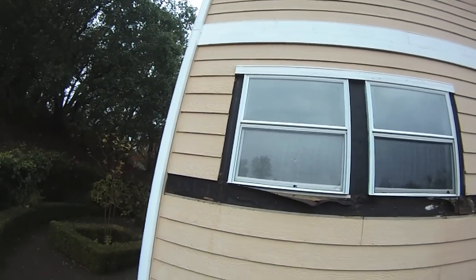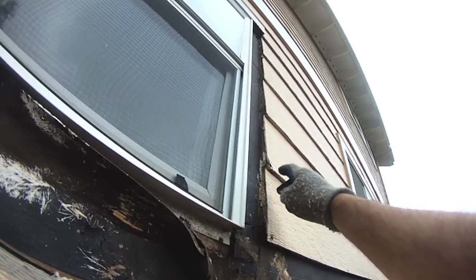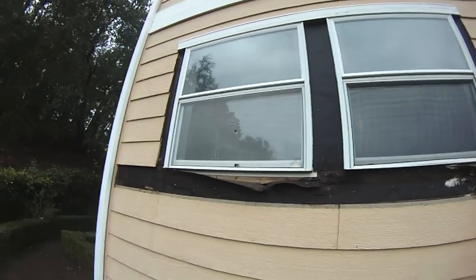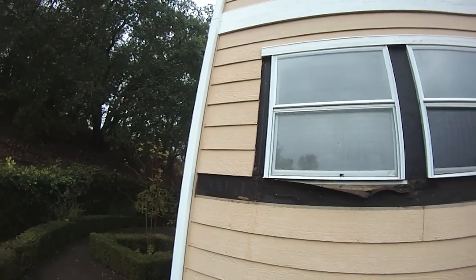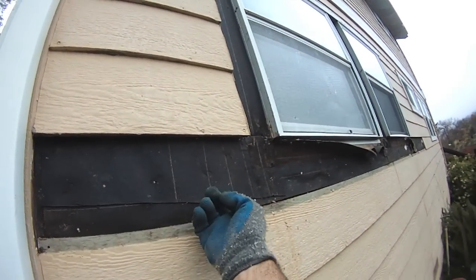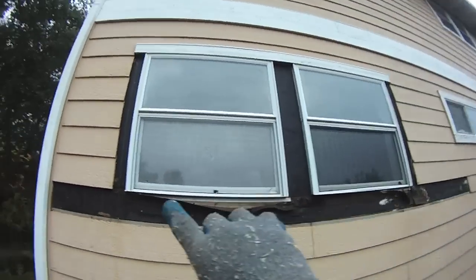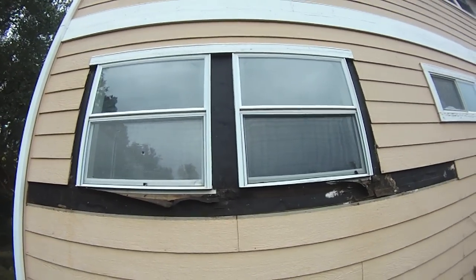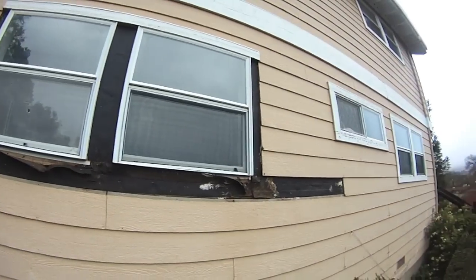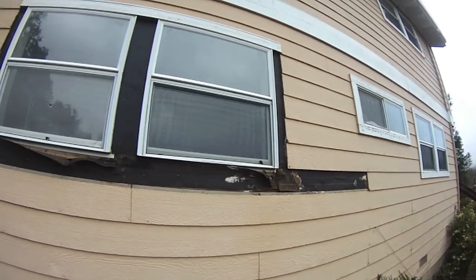So we're left with remaining siding that is in remarkably decent shape. Caulking has failed — you can see there's mold; I scrubbed that mold out. This is all in pretty decent shape considering it's just scrappy wood glued together, which is what OSB is. They did some weird papering but I'm not here to find new issues. I'll take a piece of Fortiflash, re-flash the bottom there, cut out this moldy bottom piece, put a piece of Fortiflash in, and then start putting stuff back up.